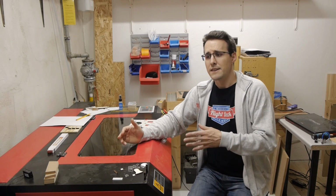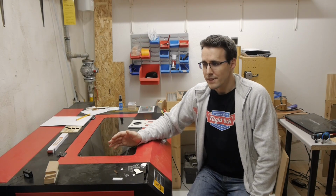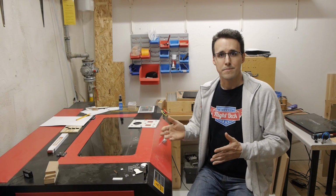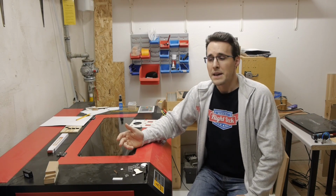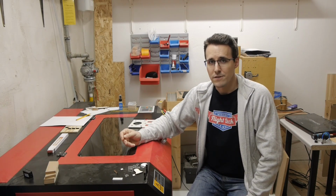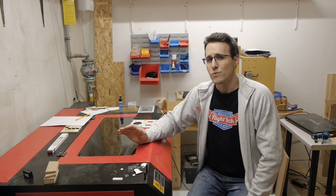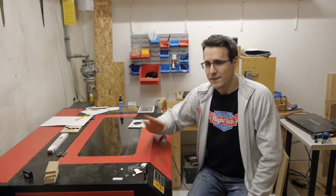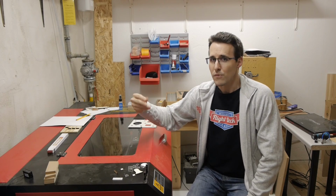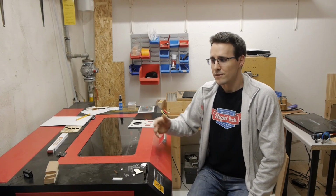My actual technique isn't too bad, but the black wax I'm using to color the engraved areas is not made to fill such big areas. It is made to fill only small and narrow engravings, only some letters or something like this, but not these lines more than a millimeter wide, for example on this pneumatic panel here. There we come out with some really thin colored areas where light comes through and they don't look evenly made. There are some areas with a little bit more backlighting, some with a little bit less, and I think we can make this look more professional.